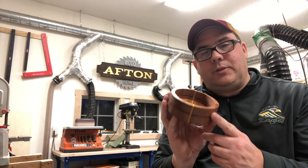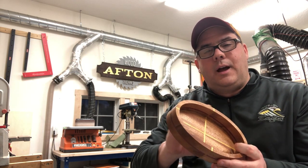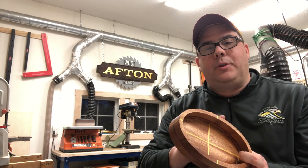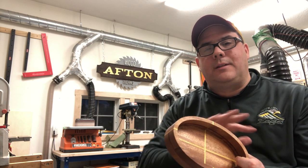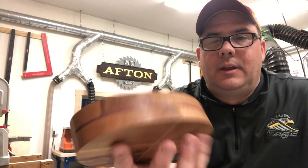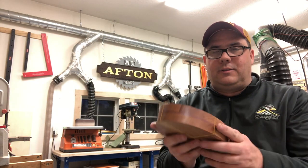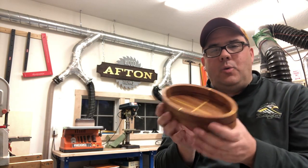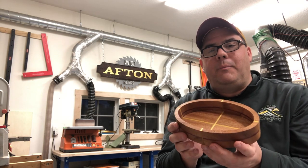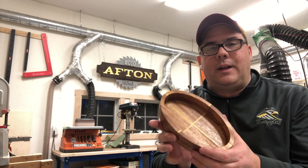It's finished with two coats of tung oil, and then I like to use a cutting board wax on it. I put that on and let it sit for about 20 minutes and buff it out. It gives it a nice kind of shiny luster but it's not too glossy, which is really what I like. Somebody said — and I agree — you want the piece to make people want to touch it, and that's how I feel that type of finish achieves that.